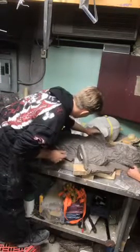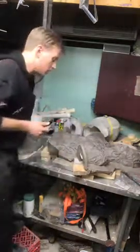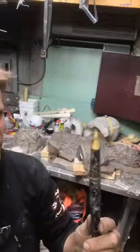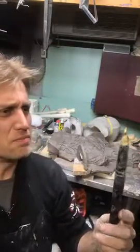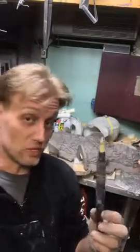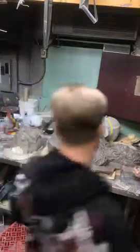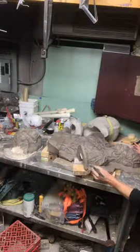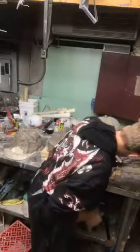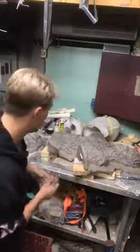The next part is the messy and time-limit part. We can take as long as we want on the mold wall as long as we keep it wet — it's water clay. The ones we have to take a long time on we do with oil clay; we've got hundreds of pounds of that. This one's water clay, it's come along pretty good. Our favorite tools are these little soft rubber-tipped ones — available at the art store for about $18, but Amazon has them for about $3. They're great for doing mold walls — a soft rubber tip won't affect your mold and lets you tuck into corners without ruining your sculpt.